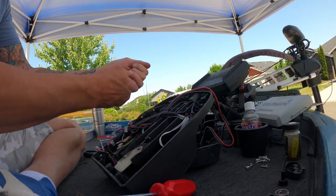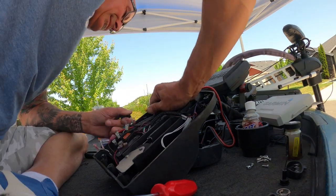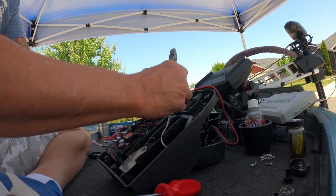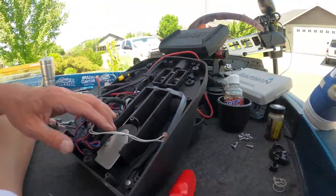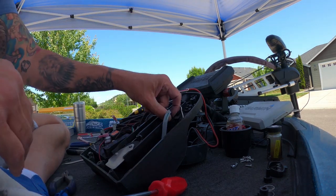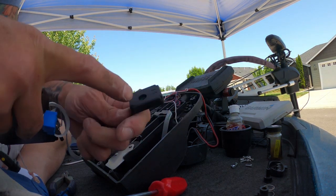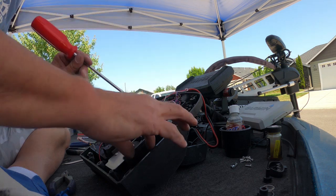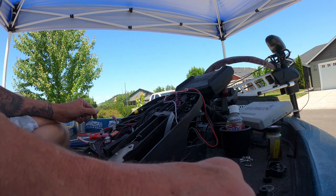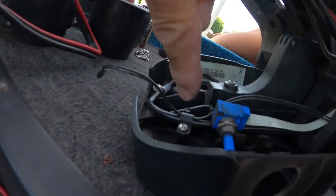This connector should have pins in it, so you don't want to be twisting on it — try and pull straight apart with just little wiggles. Got a zip tie up here to undo. Got some more bladed connectors on the back side of the power switch — we're going to undo those. Then if you follow your ribbon tape wire, it comes down to the back side of your LEDs, and there's just one screw in there. I'm going to set that screw aside next to my potentiometer dial, because these screws are different lengths even though they're the same thread count. Got a P-clip here — I have to undo that screw.